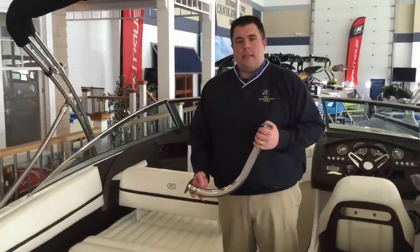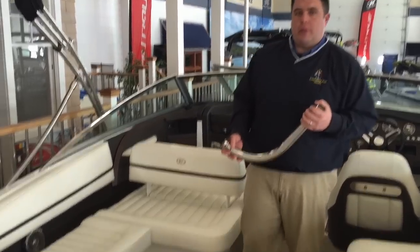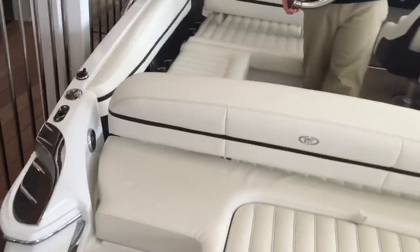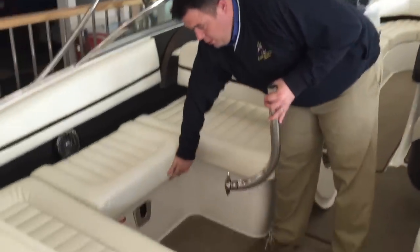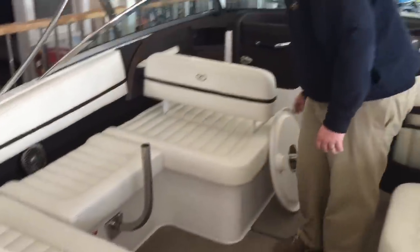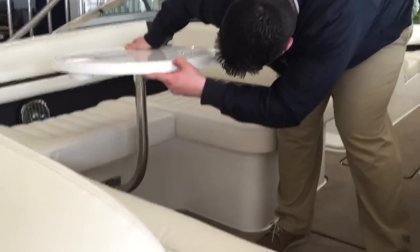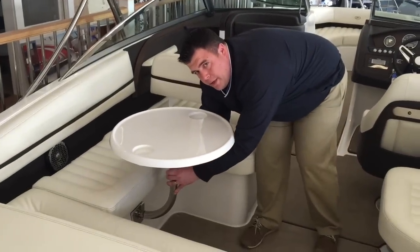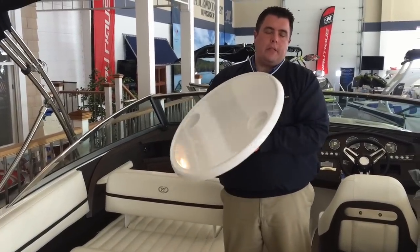If you got the optional dinette table, you need to retrieve the pedestal on the actual table itself from the bow compartment. The table will have two mounting locations on an R5 — the first one is right here in the cockpit underneath the port storage compartment, as well as on the transom for the sun pad on the back. When you want to insert the table, take the pedestal, lift up that seat to give you a better line of sight, slide it right into the receiver, close the seat. Then grab the table top itself and insert it right on top of the pedestal. When you go to retrieve the table, make sure you remove the table top separately from the pedestal — if you try to pull it up together, the pedestal will drop out and damage your boat.